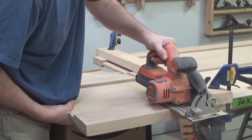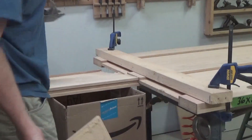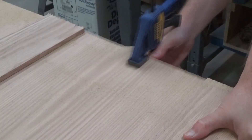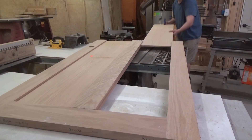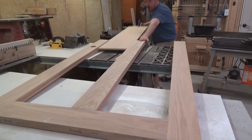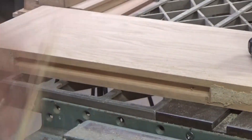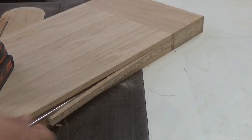It was right about this time that I realized something — it wasn't glued in. With the panels not glued in, I could squeeze a clamp onto the bottom and yank out both of those panels. They both came out fairly easily, and actually the center board came out too. With that out, I could pry out the material stuck into the dado on the bottom part of the door so I can reuse that dado and won't have to cut a new one.